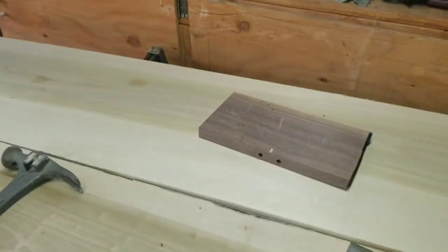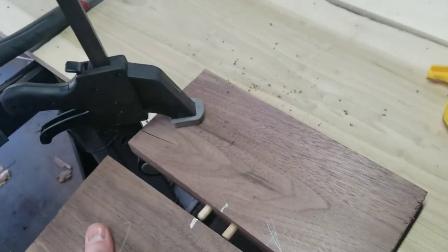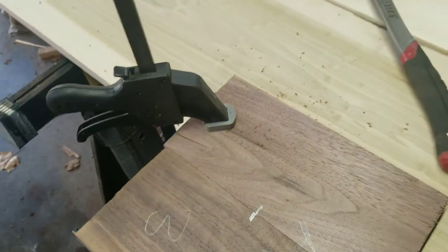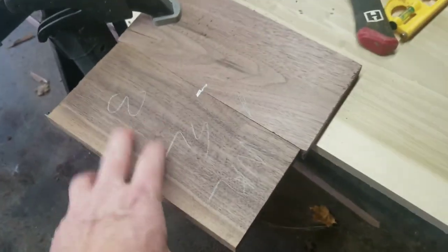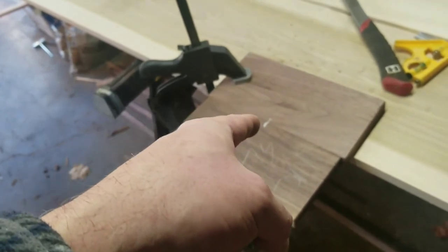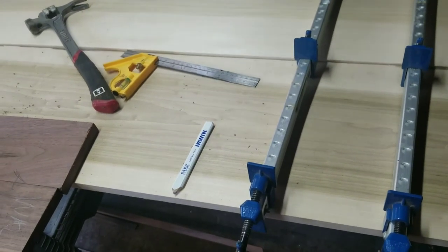I got the first and second ones cut. I put some 5/16-inch dowels in there, and it just slides together. I'll tap it together — it holds pretty well, just pushed in by hand. What you do is edge glue it. I usually put one dowel in each set of holes — one here, one here, one here — and it's usually enough to hold the whole thing together. The glue is what does all the work; this just adds a little extra stability.